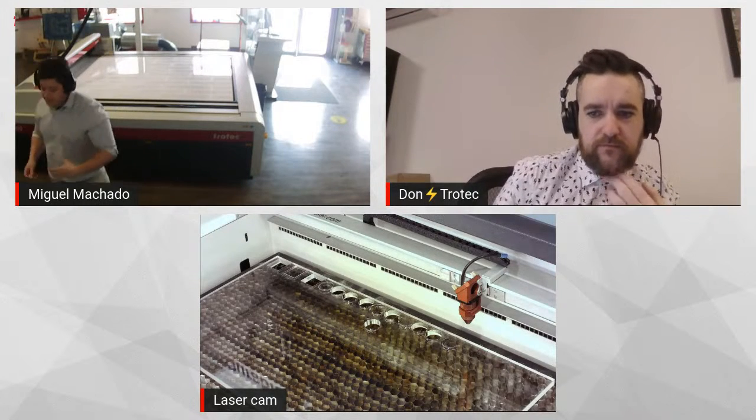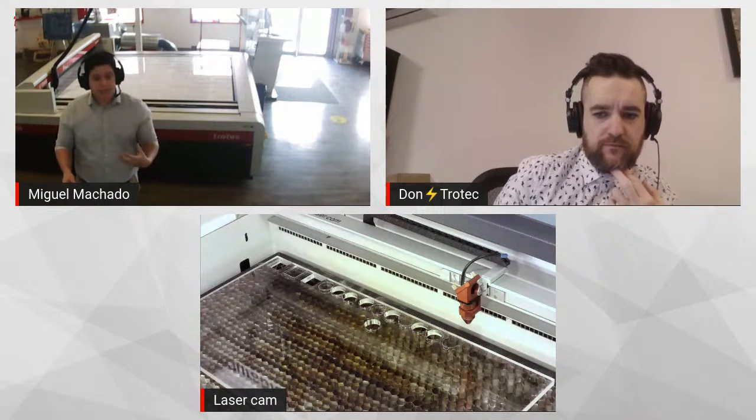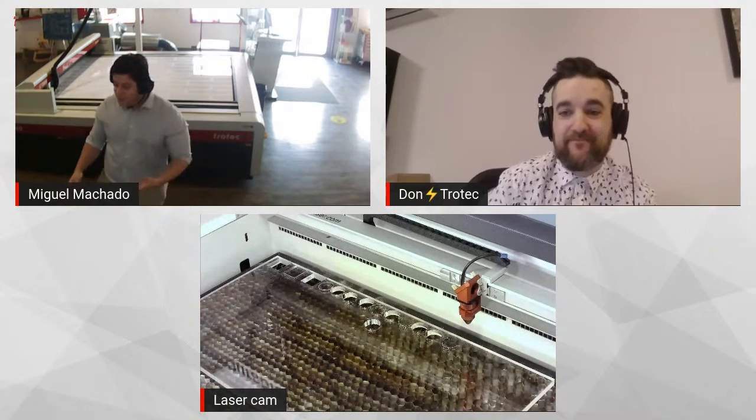I'm going to do a little bit different. Laser Dave used the whole bed with wet paper towel and the razors, and he cut it once. What I'm going to do is just do the wet paper towel after I do the razors, with the correct setting, because to me there's very little reason why you should be pushing your machine that much. Honestly, if you're having all those jobs of 20 mil, half an inch, and you have an 80 watt machine, maybe it's time to upgrade. With the ROI, you should be making enough money that you should upgrade, and you would be making more money. The machines were not made to do that.